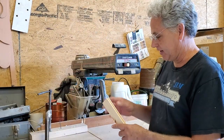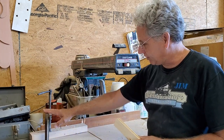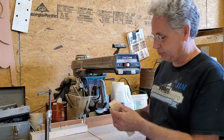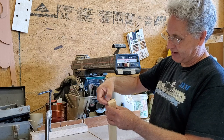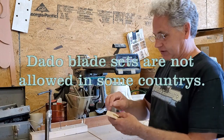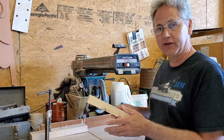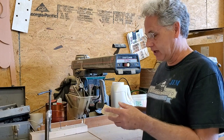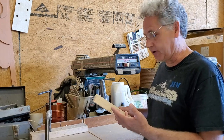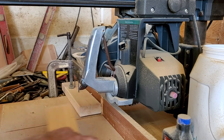Now I'm going to make my tenon. I've put a block of wood here clamped down to match the depth I need to fit into the mortise, and I've raised the blade so it comes across the workpiece and creates the male tenon. I have to make several passes to clean it out. Some advanced woodworkers won't like this technique, but these tutorials are for beginner woodworkers and this technique works. It's not perfect, but that's not what today's tutorial is about. Now I'm going to cut my tenons on the actual pieces.